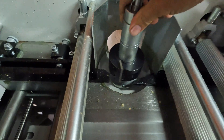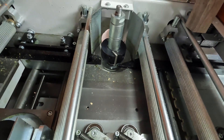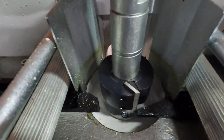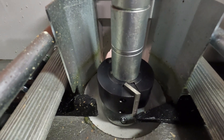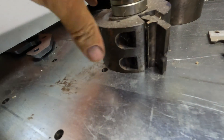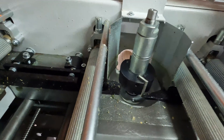Then you hit your first side cutter head. Right now this is just set up for straight knives. I've actually only run a test board or two through — I wanted to make this video before I get it all dirty and full of sawdust. You can see that's on a spindle and it has a straight knife in now, so if you were to run this it would just make a smooth planed edge on that board. But I can pull that head out and put in lots of different profiles. I actually have a second set of heads here — these are my flooring knives, carbide tipped tongue and groove. That would cut your tongue, and this one will cut your groove. So you can replace that with hundreds of different variations depending on what kind of product you're trying to make.